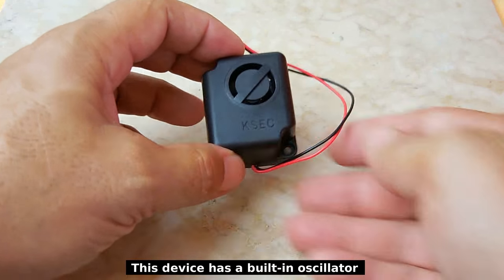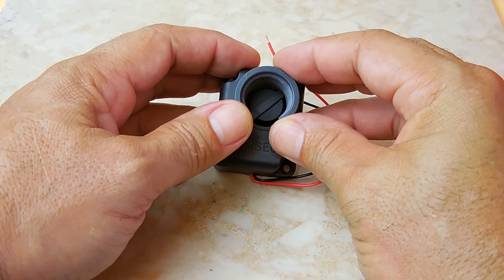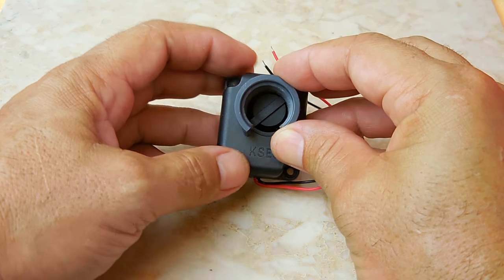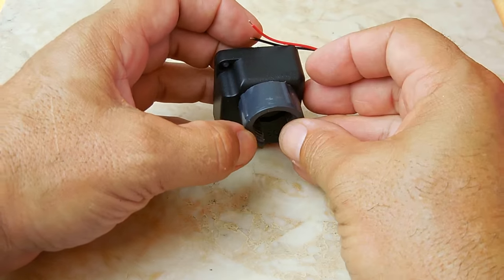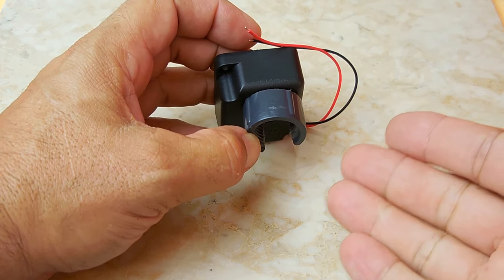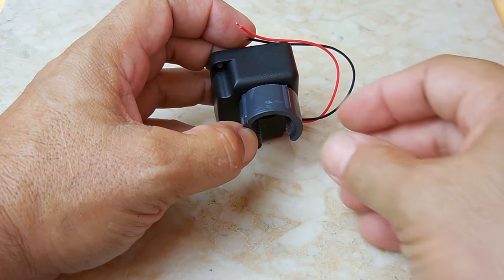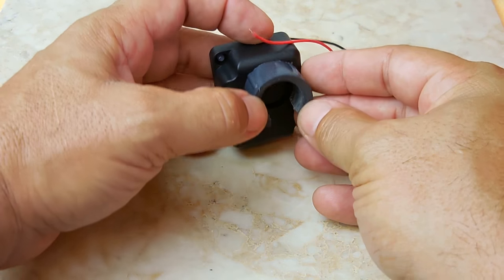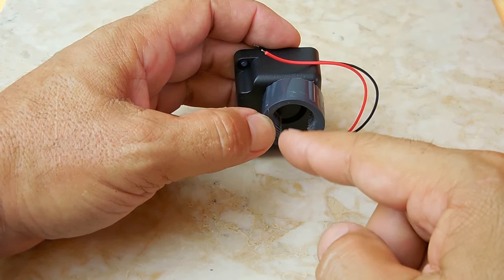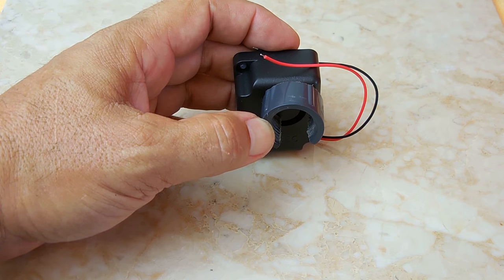The next thing I'm going to do is crazy glue this right here in position, right over like that. Center it. The reason for this is, when it rains, the rain can't go in there because it'll be raining down, and usually this is going to be screwed into a tree, and as a result, you're going to have a lot less water hitting this. But you definitely want to add this, and you want to leave the bottom open, so if any water finds its way in at an angle, it'll run out right through the bottom. So let me glue this in position, and come right back.